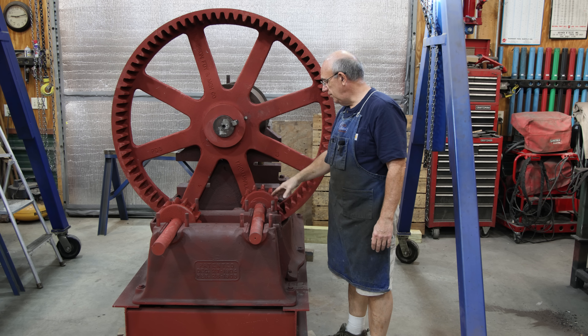There's actually another reduction as well because out here you've got a big pulley. This pulley is four feet in diameter and the pulley on the engine is going to be considerably smaller — let's say one foot in diameter. So you've got another level of reduction between the motor and the machine. So 19 to 1 ratio in the gears, and then another pulley reduction from the engine, really multiplying that torque and reducing the speed all at the same time.